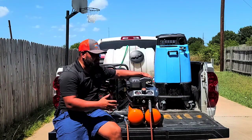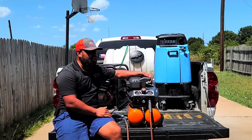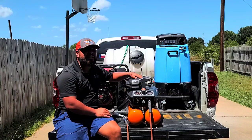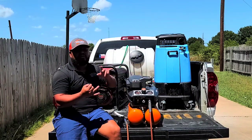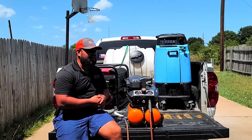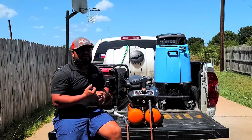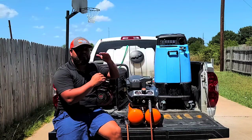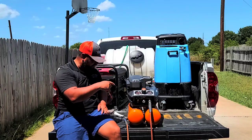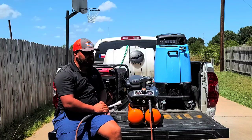Now, many people will say, well, you downgraded because you only have 4.5 gallons, right? In a way, maybe I did downgrade, but I upgraded tremendously in the CFMs. This one at 90 PSI, which is what our Tornador and our Vortex air tools need. Any air tool we use sometimes requires about 90 PSI, and the CFMs are always higher because you want that output coming out to make sure that this thing spins correctly, right? And you don't lose that much pressure.